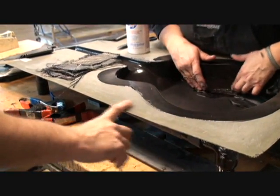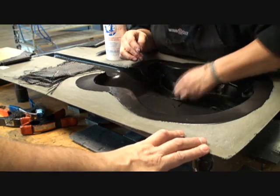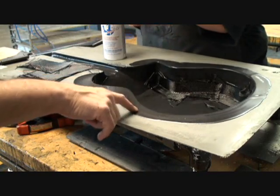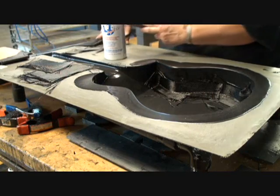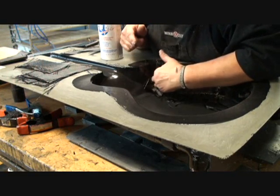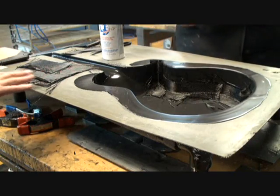This is the mold itself. Our bodies are laid up into molds. These molds are made from carbon fiber as well — we make all of our own molds. Once we get a mold made, we gel coat it. This is an epoxy coating, and then we lay up our carbon fabric into the mold. We use a little bit of spray adhesive to put the pieces in place.